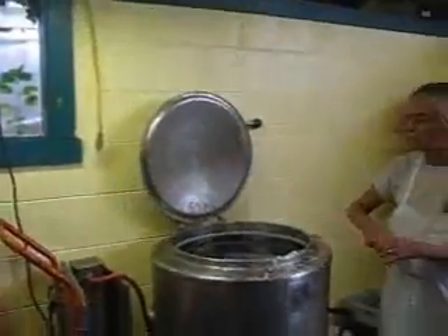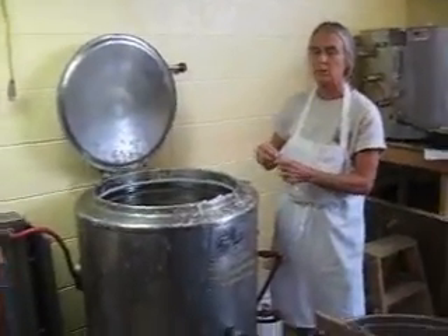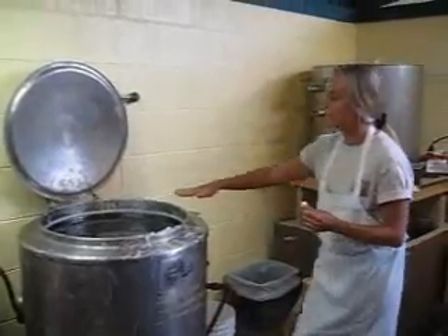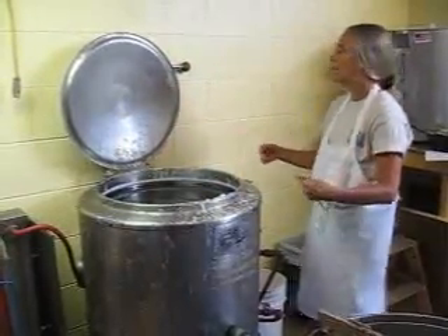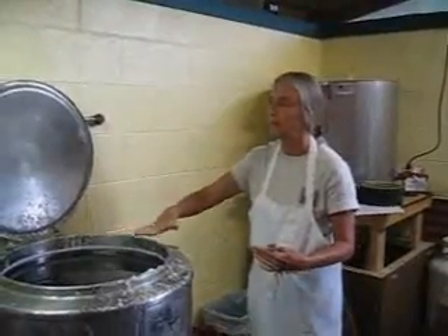As we go through with this operation, when you're dipping and dipping continuously it does make the water temperature go up, so we check it now and then. As the level goes down — because there's only so deep you can put the board in due to the concave in the tank — we keep this one filled so we can top up the level.